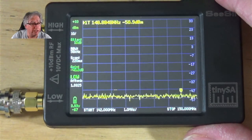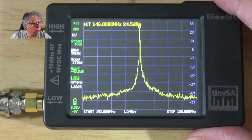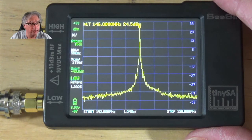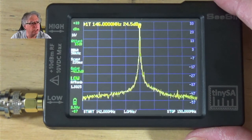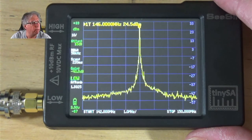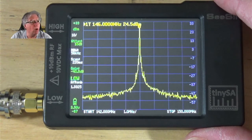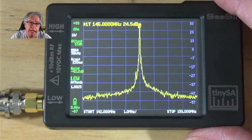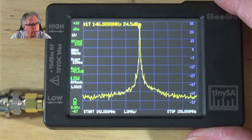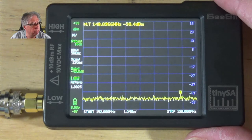All right, I'm on low power at 146 MHz. Keying it — it's showing a little less than one watt, right on 146 MHz. There could be some attenuator error, or maybe my battery is a little low, or perhaps the Yaesu isn't quite putting out a full watt. Either way, that's acceptable — it looks pretty good.